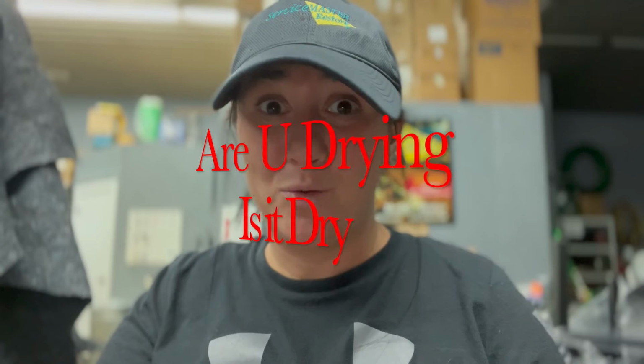Okay guys, I want to make sure you remember and know that dry standard is different based on the job site and environment. So you want to make sure that your first step is finding that dry standard so you can determine if you're drying and when you're dry.